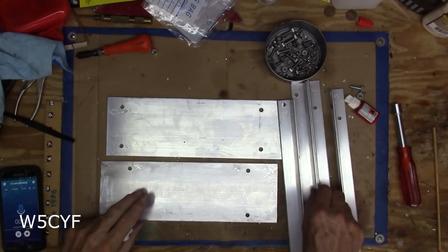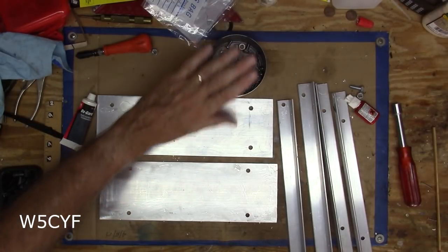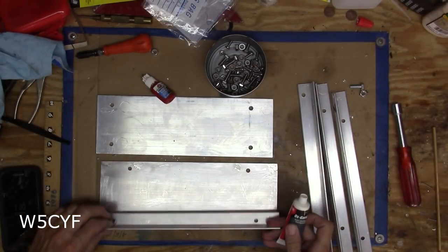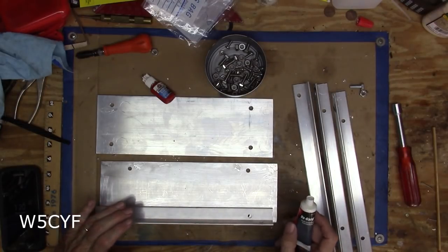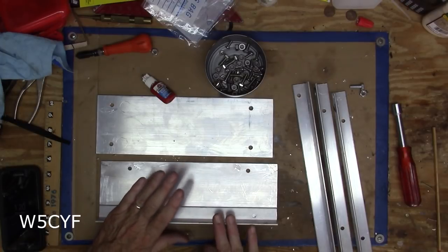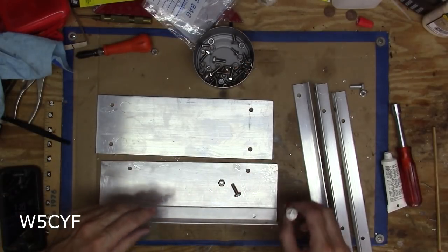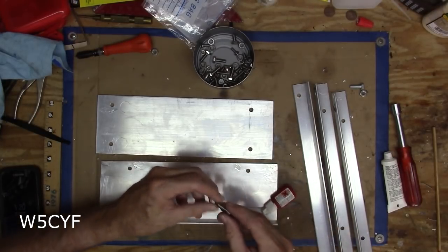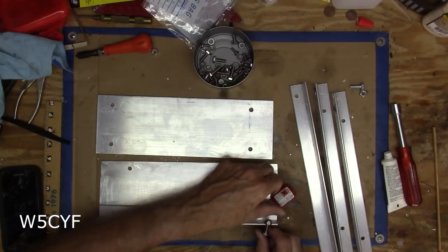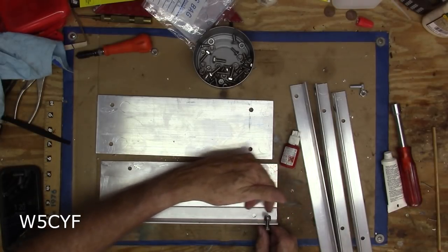At this time I've got all the parts cut out — the front plate and back plate, and the four pieces of angle iron. I'm going to use 100% stainless steel to put everything together. I'm also going to use ox-guard along each side to help with the corrosion factor, prevent corrosion, and help increase conductivity as it sits out in the weather. I'll be using all stainless steel fasteners throughout, and on the nuts, instead of a lock washer, I'm going to use a little bit of blue Loctite only on the threads of the bolt. Down here where the hinge is, I've got nylon lock nuts, so I can tighten it just enough that it'll still leave the ability to move back and forth.